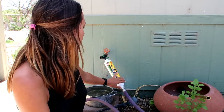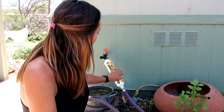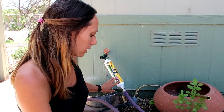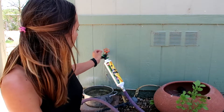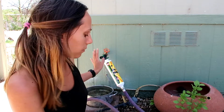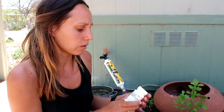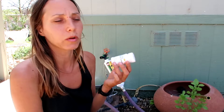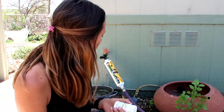The filter goes up to 10,000 gallons supposedly, depending on various factors. There's no display showing how many gallons have flowed through it, but one way to track it is what I'm going to do right now — use chlorine test strips, and once it stops removing the chlorine, you know to get a new one.